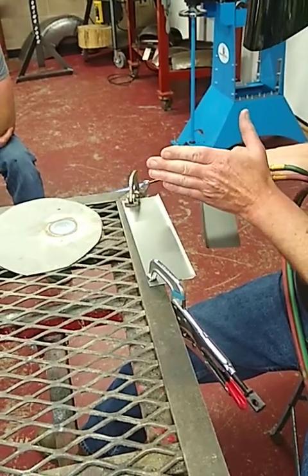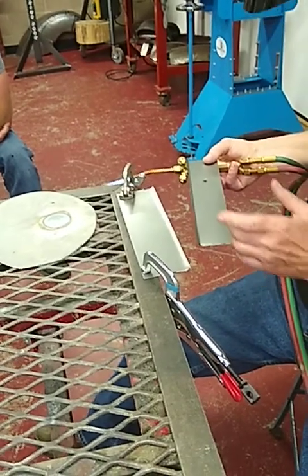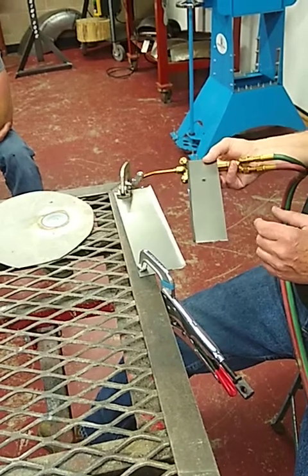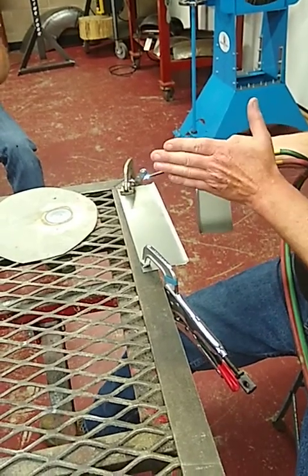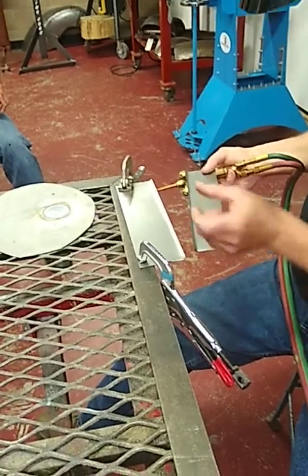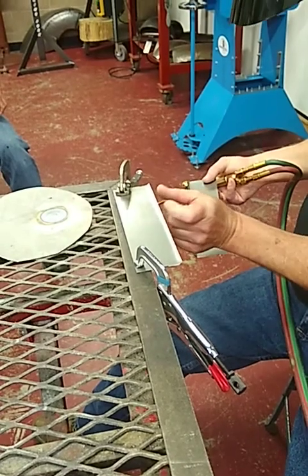It's still two inches apart. One direction only — keep it in a rhythm. So if I start with an inch tack, I keep an inch apart. The first tack gets split in half again — they're still an inch apart.